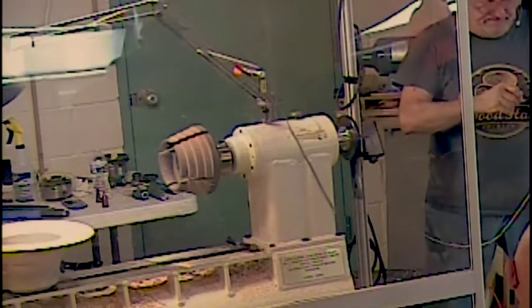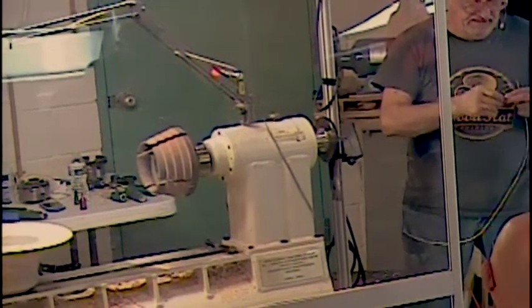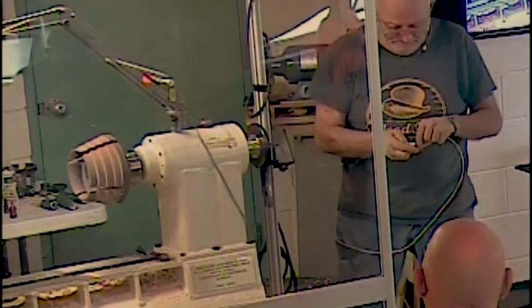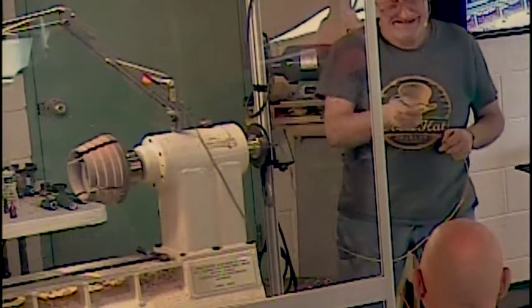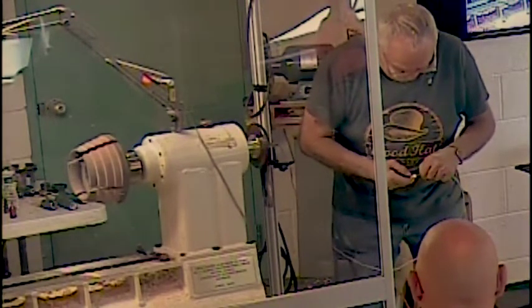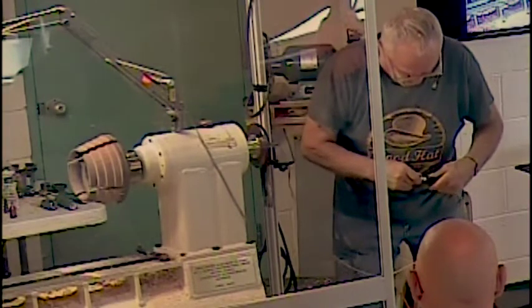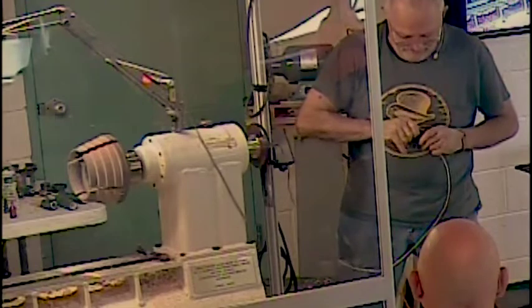Plugs. These come out just by squeezing the legs together, and you spread the legs open. There are two little points that pierce the insulation. And everybody says, where'd you get that? It's every hardware store from coast to coast. They all got them. Been around forever. No tools required. This is speaker wire, so sometimes these have a hard time making connection. The wire's a little too narrow.